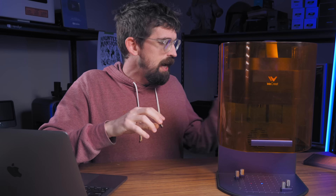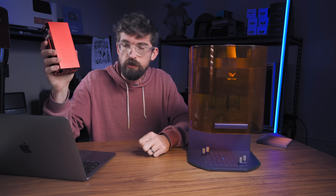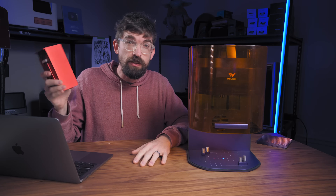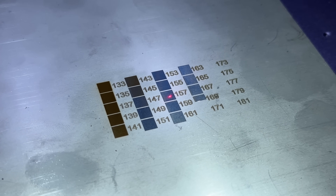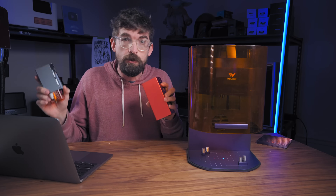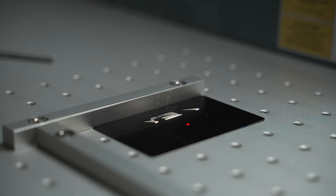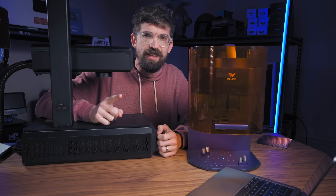What is really unique is their IR module. IR literally means infrared, and because of that wavelength you're able to interact with other materials, specifically metal. Something that's kind of universal with diodes is the laser dot is kind of messy. Diodes do have better beam quality than a glass CO2 laser, but a normal diode is not going to be nearly as nice as what a traditional fiber laser can do for you.